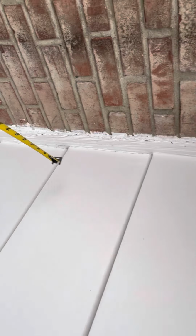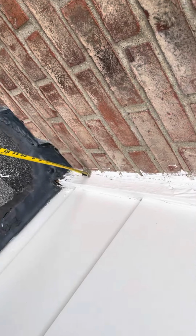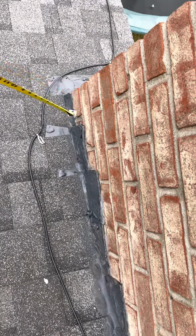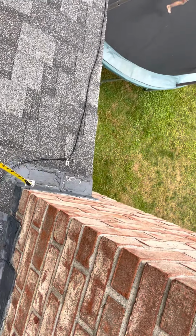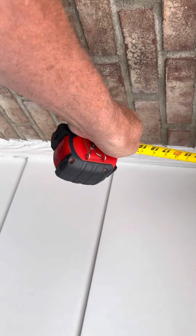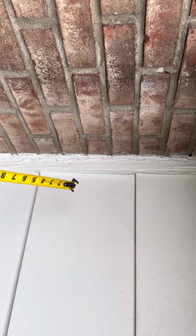So what I would like to do is take and saw into this siding, cut into the siding, okay, and then we would want to come up here about 6 inches and do a straight cut into the brick and the mortar. Grind in about 1 inch and put a brown counter flashing over top of all of this and flare it onto the roof. And obviously do the base here first. So we wrap it around, and any water coming off this chimney is always being diverted down onto this roof. And then cap this off with a white aluminum going up in here and sealing it to the siding, and then just coming out 3/4 of an inch onto the brick. So that would protect this piece of shingle here.